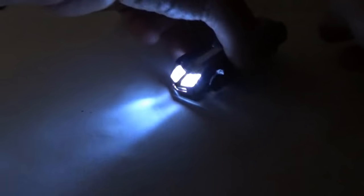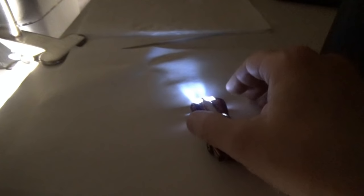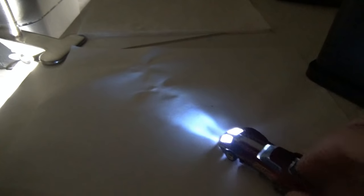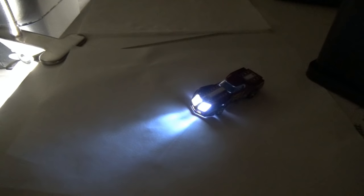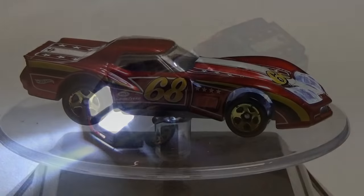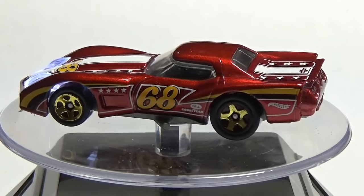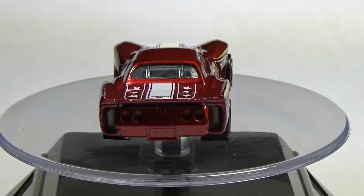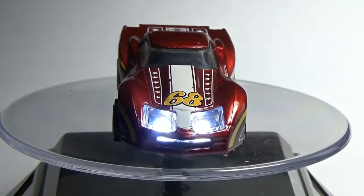Keep in mind that every car is different and how you place the circuitry will vary, but the circuit itself can be the same from car to car. You can also remove one of the LEDs without affecting anything, and your batteries will last longer. These super-bright LEDs are energy hogs — I'd guess about an hour of run time. You won't fully drain the batteries; you'll just drop below the voltage the LEDs need to operate, which I tested at just under 2 volts. You can easily swap in a fresh pair. Parts are common and eBay is your friend. If you enjoyed this video please thumbs up, and I'll see you guys next time.